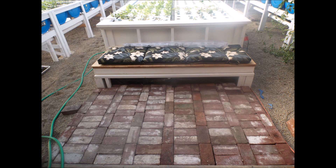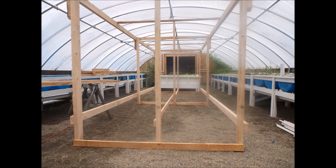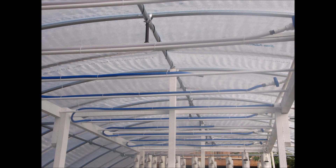This is the entrance from the utility building into the greenhouse. The third growing method in this system is going to be grow towers. This is the framework to suspend the towers — my sister is painting the structure as I get it completed. The vertical post is tied into the purlins of the greenhouse structure; this is for helping with heavy snow loads in the winter time.